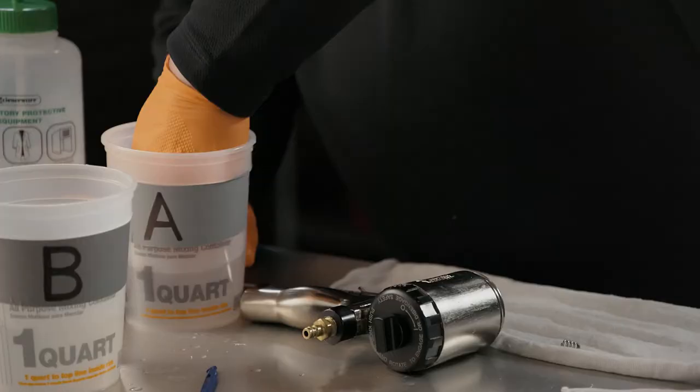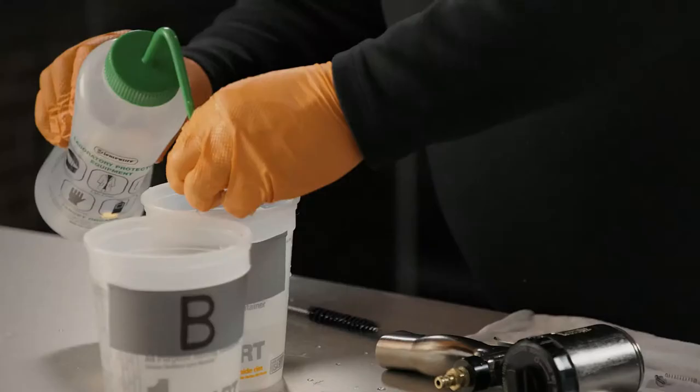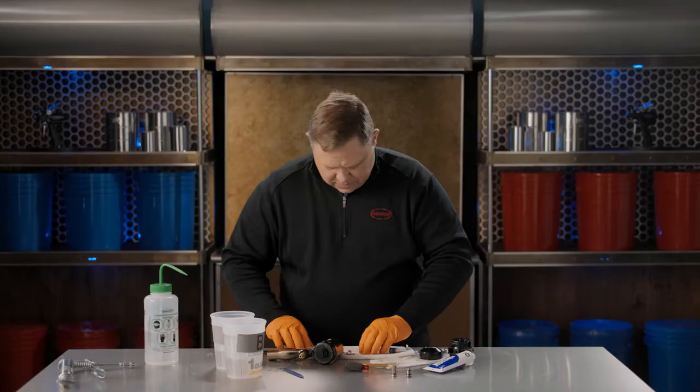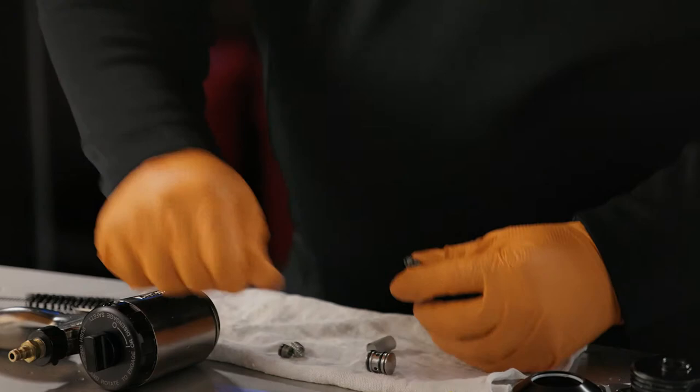Now for the A-side parts. While we're cleaning our parts and removing things with clean solvent, you can also use compressed air while you use your brush. Air does a great job of knocking things out of small orifices. Once ready for reassembly, put the ball in, then the spring and post for the check valve on the A-side.